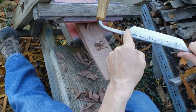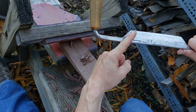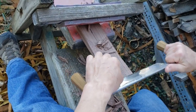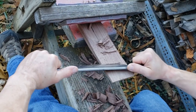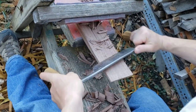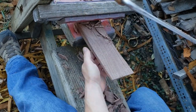One reason I clip the corners on draw knives that I make — so it's at a 45 degree angle instead of having a hard square corner — is that when cutting at a diagonal like this, a hard square corner would leave deep striations and gouge marks. Clipping the corners helps to minimize that. You can modify any draw knife that way.